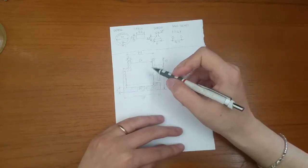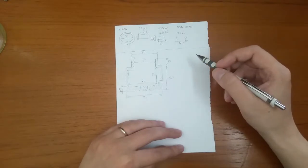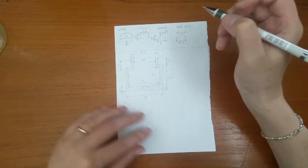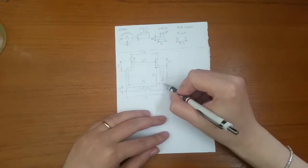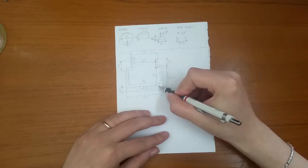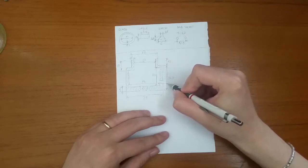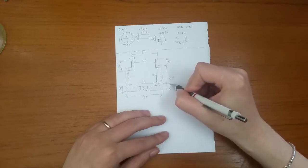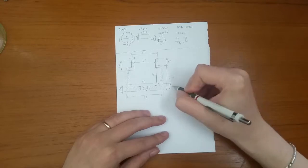Just as a note, I created the neck of the base to be a little smaller than the diameter of the cut bottle glass, the fit between those two being a very loose one, because even if I use the same type of bottle, the diameters of the bottles are not the same. The tolerance in creating a bottle is poor. So, loose fit, then adapt. You'll see how.